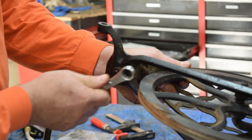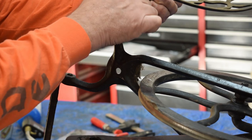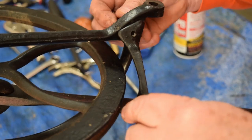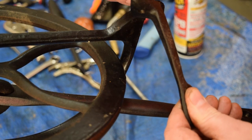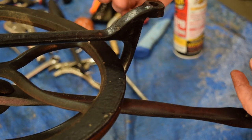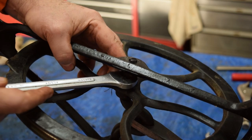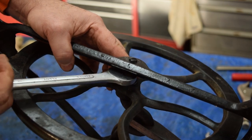Next off is the dress guard. Okay, next off is this belt guard. I've loosened the bolt, it's a screw head. That's off. And the last thing is the flywheel assembly. And there's a 3/4 inch nut underneath it that we're going to back off.